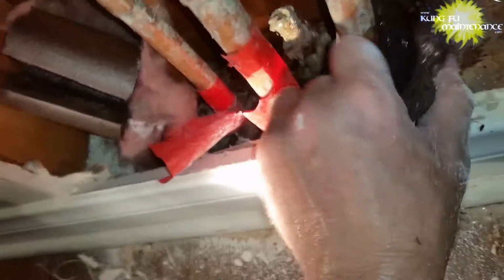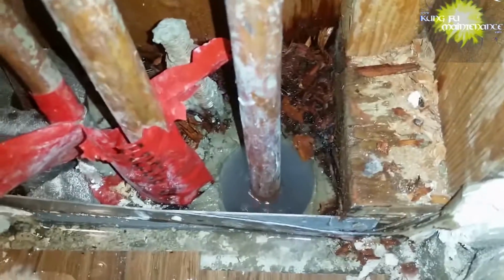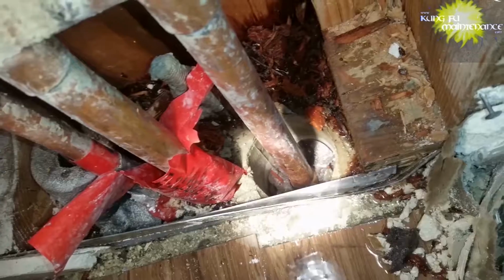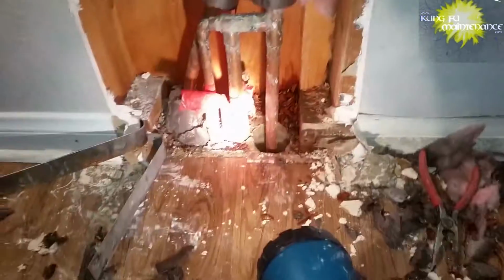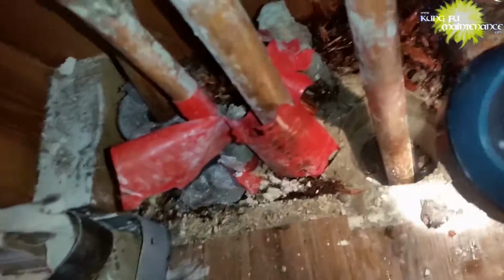Sometimes we can be way underground and the water can travel the sleeve and make you think it's right there, and in reality it's 6 feet that way. So this one I had checked out the day before, had a report that they could feel hot water in the floor all the way across the living room. And that just suggested that maybe there was a leak. At that point I had no water coming up, but here it is the next day, water coming up.